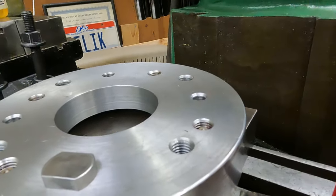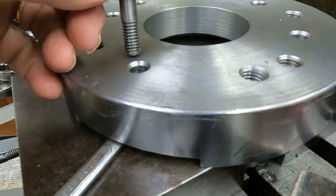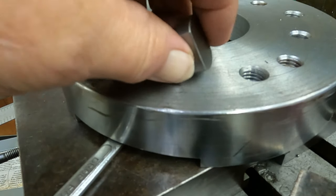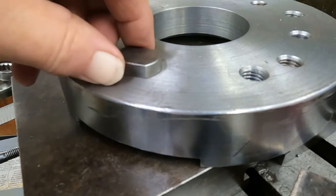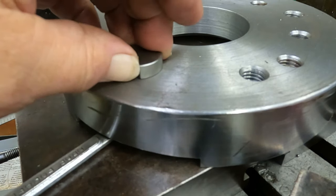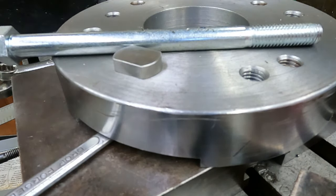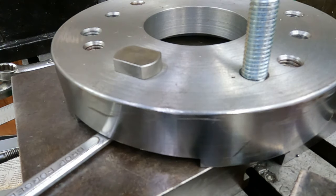You wonder — is Kimber ever going to mount this adapter plate? This is what the T-nut looks like; this is one of the original T-nuts from the South Bend. They're not long enough for this application, but this is kind of how it's gonna work: this will lock into the ring, and then there'll be a nut under here to draw that tight and hold it to the base of the machine. Then the Condor power mill head will attach here with four half-13 bolts.